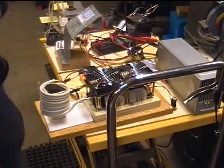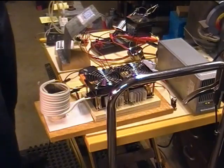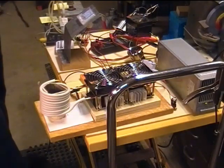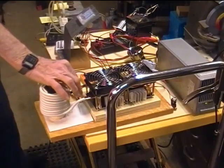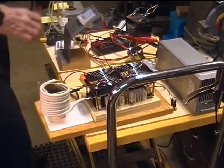So what are the final numbers here? We went from about 16 degrees Celsius to 19 degrees Celsius. We had excursions from about the 4 or 5 amps of idle current up to, I think at one time, we even momentarily went up to 45. The power supply, and I guess I didn't read the voltage off, I've never seen it go below about 47.8 volts, no matter what I was doing to the rest of the system. Again, the water is just, boy, that's great. You can still feel it's cold coming in, and it isn't even body temperature going out. Well, there it is, 19 degrees Celsius.